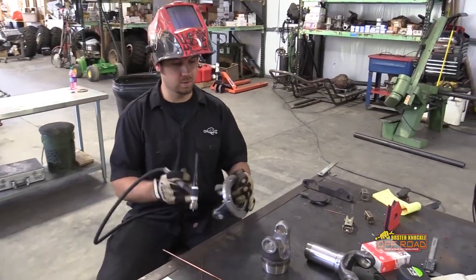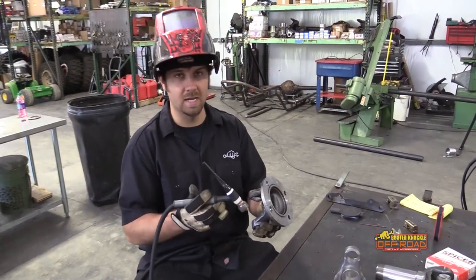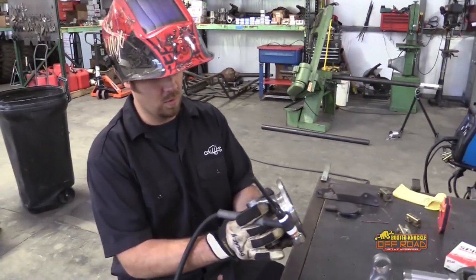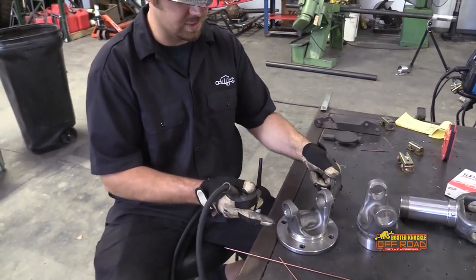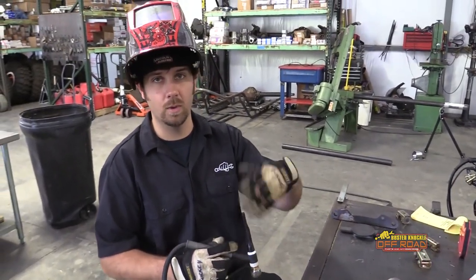When putting these yokes together — whether it's the yoke with the adapter or the dry flange kit — you want to make sure you tack it in a bunch of places so it doesn't try to pull off center when the weld cools. I like to tack it in 8 places: hit all 4 quadrants first, then split each one — so 1, 2, 3, 4, 5, 6, 7, 8. Before you weld out, make sure you tack it all the way around in a circle.